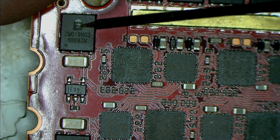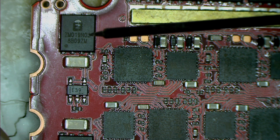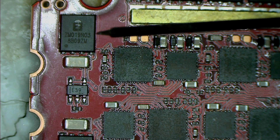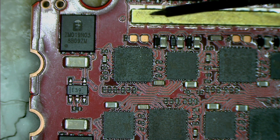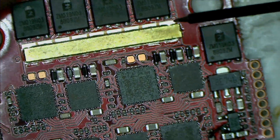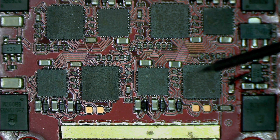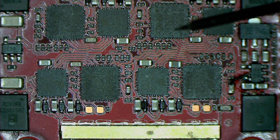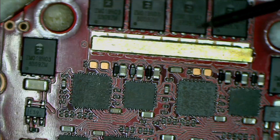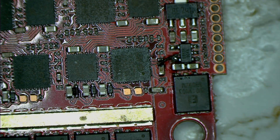The FETs we chose have been tested at up to 50 amps continuously at full throttle for a whole pack with no overheating or problems. These FETs have been great even at high-KV 6S — I don't necessarily recommend high-KV 6S because you'll exceed 50 amps a channel, but it should work. Our racers beat the crap out of this stuff. A bigger ESC has more heat dissipation because it's a bigger board, the whole board acts as a heat sink. This ESC is all about durability and maximum power.